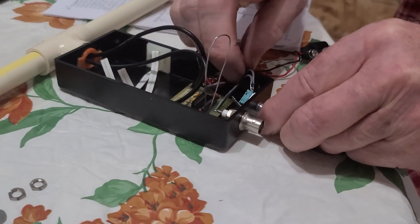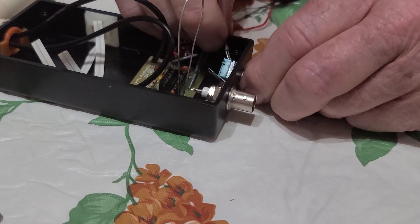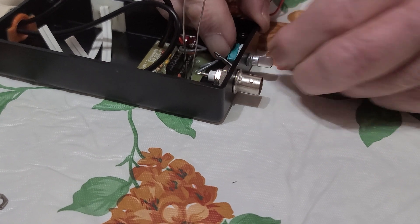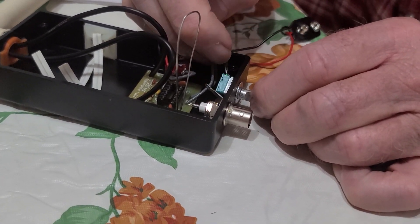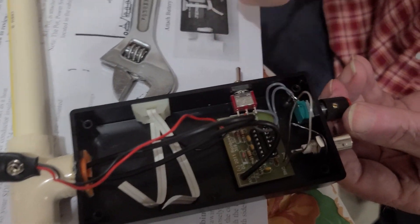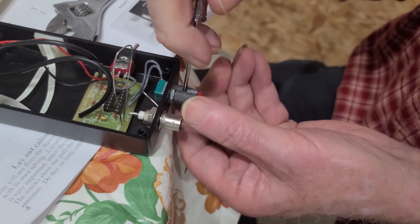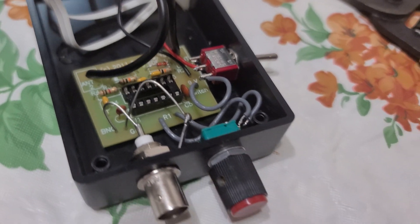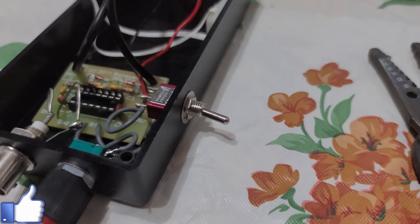Getting towards the end of the build now. They've got most of the components in the box — the little motherboard — and they're putting in some of the final control units and components that come through the box itself. They just had to make that one hole a little bigger. They're putting the washers and nuts on to lock those components into place. That loop of wire sticking up there is going to get cut and become the connector for the antenna with the BNC connector. There's also plenty of room for the 9-volt battery that powers the unit.